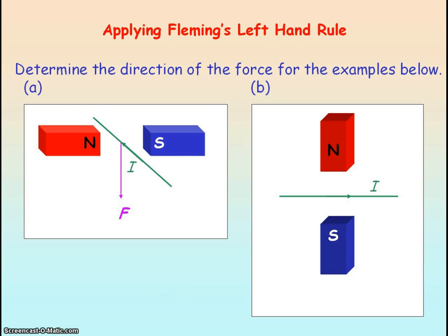For the second case, take the first finger of your left hand and point it in the direction of the magnetic flux density — from north to south, so the first finger is directed vertically downwards. Take the second finger of your left hand and point it in the direction of the current, pointing to the right. Keeping the relative positions of your thumb and first two fingers the same, the thumb points into the plane of the screen, so the magnetic force on that conductor is into the plane of the screen.